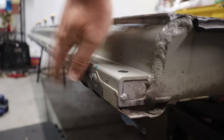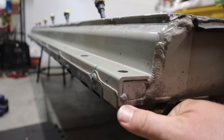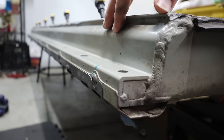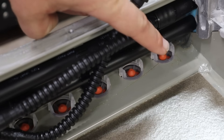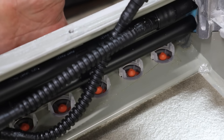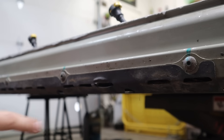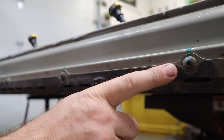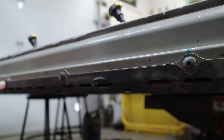Today I'm looking at the sides of the battery pack. We have these rails that go down the sides, and there's this part underneath held in by screws, and that's what covers those umbrella valves. Unfortunately, it looks like dirt can get in there. So I'm going to take this off and see what it looks like under there. Here are those umbrella valves on the outside, under that ski side rail that covers them up. The cover is held in place with T25 screws. Some of them are dirty — this one here has some gunk in it, so I'll have to stick a pick in there before getting that one out.